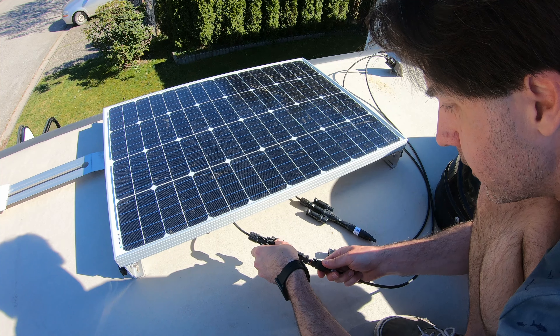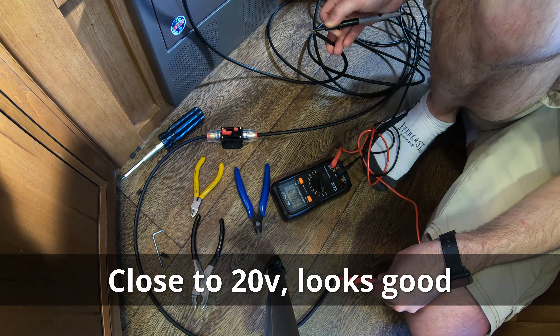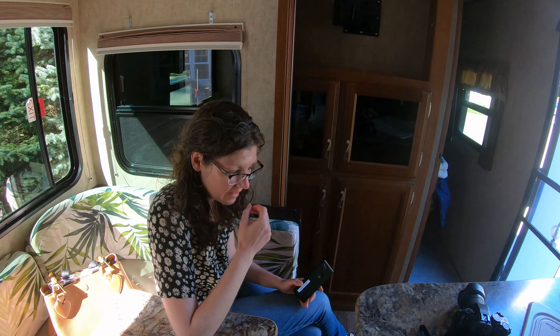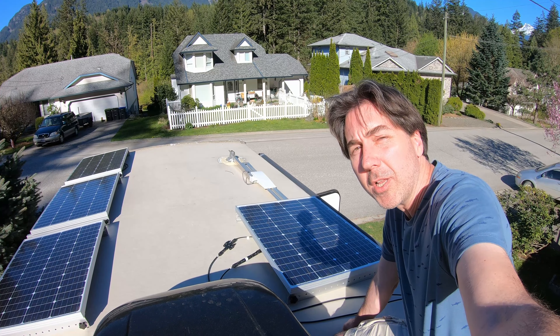Everything is disconnected in the trailer, so I'm going to plug stuff in up here. We're plugged in. Down in the trailer now, I've got the positive wire on a circuit breaker so I can switch it on and off, and I'm just going to test out the voltages. It's reading 33 watts — and it should be around 100. So maybe we need to see if we beat the trees. I've got one panel hooked up in a temporary fashion — it's not giving that much power, but I think that might be because it's partially shaded right now. This panel is only generating about one-third of what it should be, because the sun's already into the trees a little bit and the panel is tilted away from the sun.